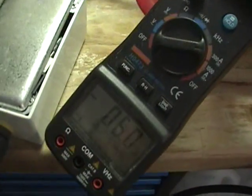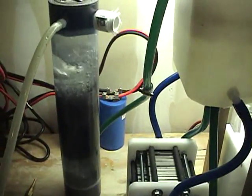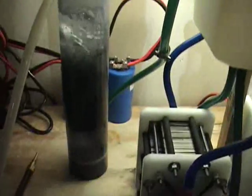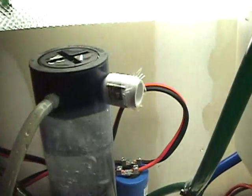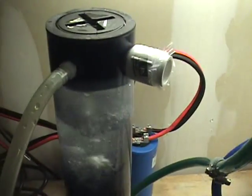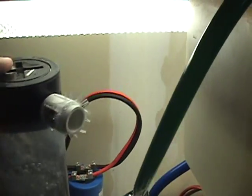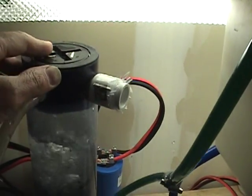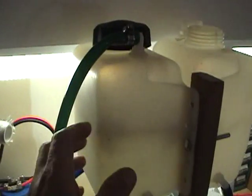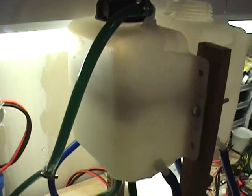We're running about a little over 6 amps right now. The max on this is 15 amps. We're running about 7 liters a minute. I've got my bubbler here. The bubbler does have a flash port. So as we're testing these flashback arresters, I am being safe — this port has been tested. It works very well to stop the flashback from making it to this area here. Making it here is bad news. I've seen one of those blow up before.